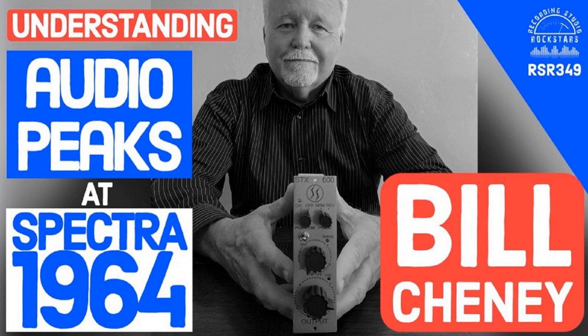One test for Spectra mic pres is to shake car keys in front of a microphone — it's doubtful the meter will even deflect, but you hear hard distortion. Those are transient peaks that the instruments don't even recognize. Everybody settled on just giving yourself 10 dB of headroom to keep away from peak overload. But that's not true, because Spectra's definition of a peak is that it is well beyond 100 kilohertz, has no musical program, and is purely voltage.